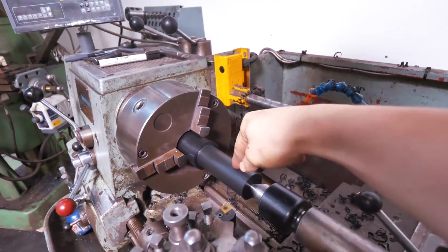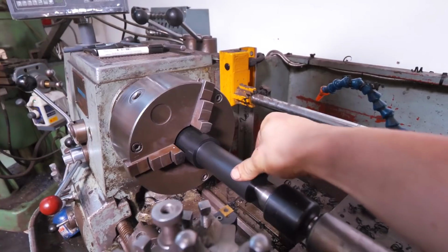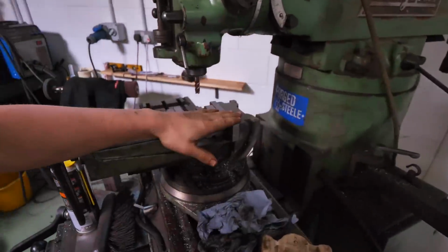I certainly know that I can't grip onto a taper in the mill without making myself up a collet, which is actually possible. I have plenty enough Delrin to take a larger piece, drill a hole, machine in the exact same taper as what I turn here, and then cut a slot in it, and use that as a collet to have parallel sides that I could then mount the taper in my vise. That's a possibility. That's a decent amount of time.